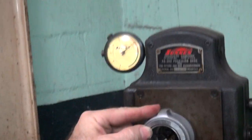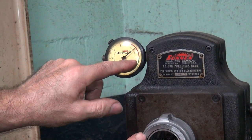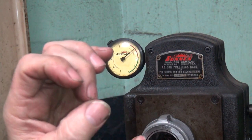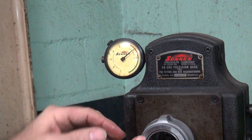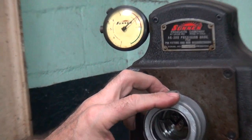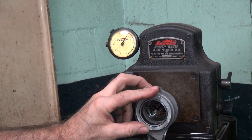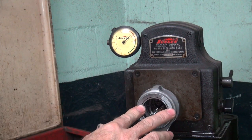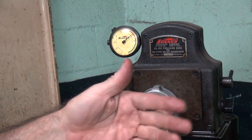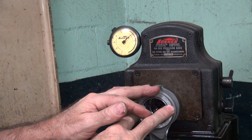Okay, we've got to figure out our bearing clearances. The rod was one tenth under the zero — zero is our starting point, that's how we had that checking standard. One tenth under because the crank is one tenth under size. So you start your number at one down, then add your clearance. We want nine tenths to twelve tenths clearance on the rod big end. Nine tenths is over a stock normal motor. Hot rod motor you go up to ten tenths or one thousandth. The more progressive, you go up to twelve tenths. For a racing motor you bump that up to one and a half, one and three quarter, two, two and a half, three thou clearances.